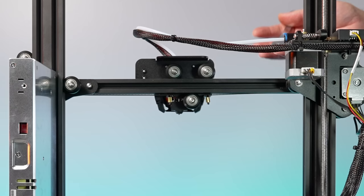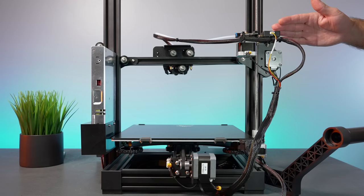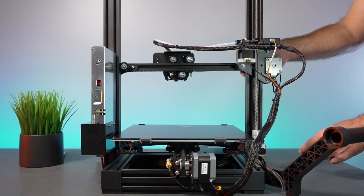Grabbed the wrench and loosened the x-axis roller — it was extremely tight. Got it loose but then too loose, so went back the other way. Now I can turn the roller in one spot and it's nice and smooth. It's not complicated — just a little bit of adjusting — but this is more important than anything else. Getting your printer smooth and aligned is what makes the biggest difference in print quality.